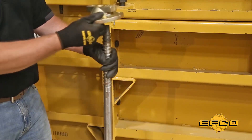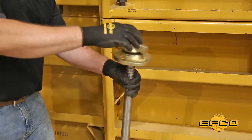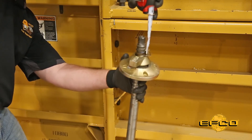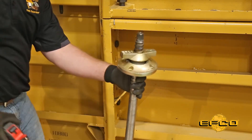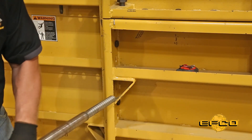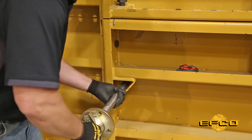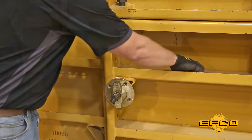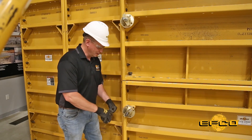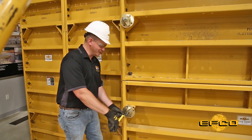First step is to put the wing nut onto the end of your tie. We'll go ahead and measure down — make sure we're set at an inch and a half, and we are. And then the next step is to insert your tie into the wall. Last but not least, you want to make sure that you've set your tie correctly. Right here we have an inch and a half sticking out, so our tie is set properly.